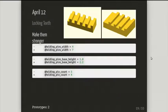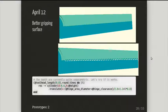In my code that was a really quick fix to make it stronger. I tried to make every parameter parametric so I could change the width, height, and pin count and make another prototype in a few minutes. I was also working on getting a better grip on the tool head, because the previous prototype had a really flat surface that didn't provide much grip. I deleted a few cylinders along the sides of the tool heads, and even though I was sure it wouldn't print as shown in the OpenSCAD model, I actually got a surface that wasn't smooth — so that was a plus.